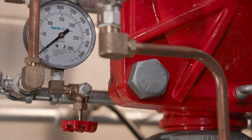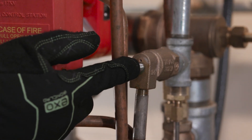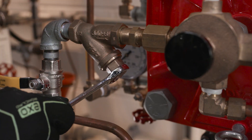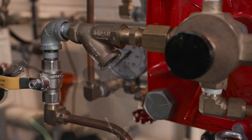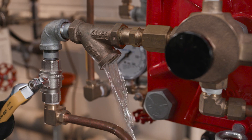Why should these valves stay open? This is simply to make sure the system is no longer pressurized. Now, depress the automatic drain valve plunger to verify that it's open. Then, clean the diaphragm supply strainer by removing the clean-out plug and the strainer basket. You can flush the strainer by momentarily opening the diaphragm supply valve.